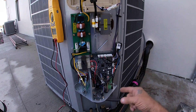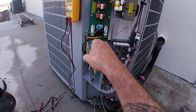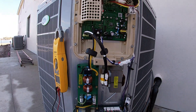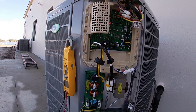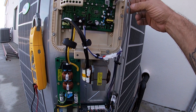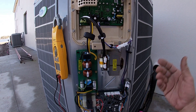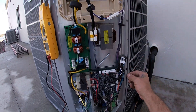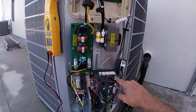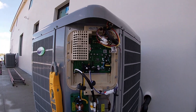I trimmed back my low voltage — they had it looped up, but that's how I diagnosed it. I had my lights on the PCM, high voltage was going through the filter board, so I knew I had power. I've got another unit where the harness wasn't plugged into the VFD, which was throwing the communication code. When we opened that one up, we found a wire buried in there — and then found the sensor was missing. I'll have another video on that one.